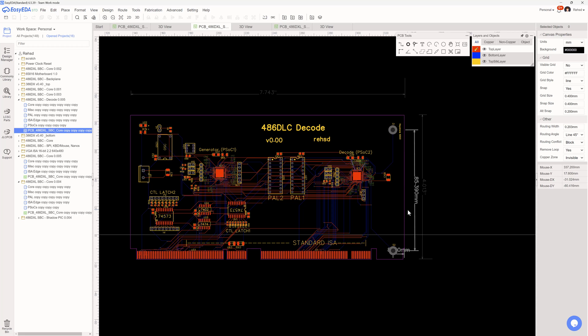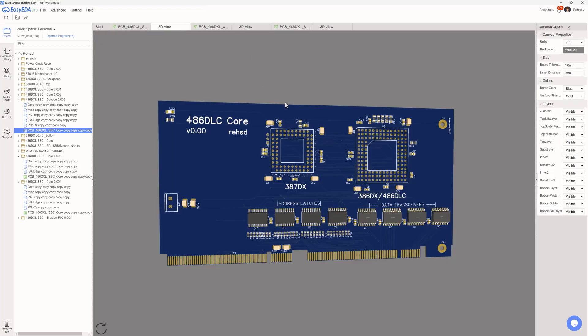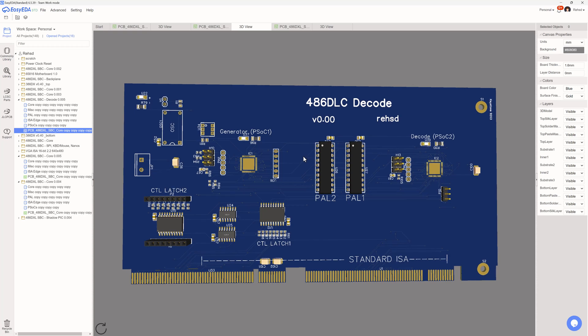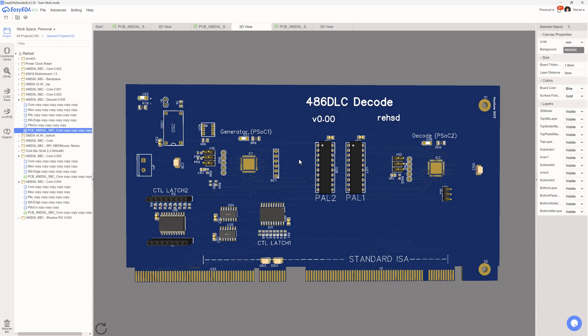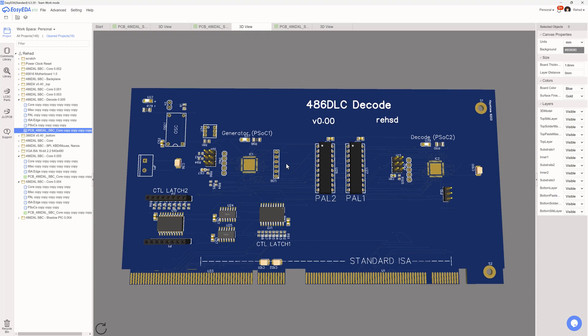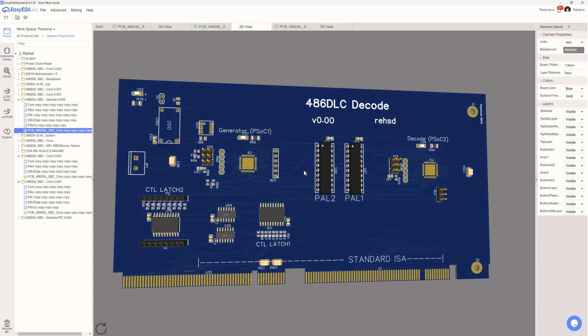I was trying to consolidate things, but since I'm learning so much of this PCB design work, the multi-card approach might be the safer route for experimentation. It makes routing much easier — I have lots of room to work with on these cards, and I don't have to worry about cramming everything together or going to a six or eight-layer board with complex routing. So maybe three cards plus a backplane is what I'll do in the next week or two.